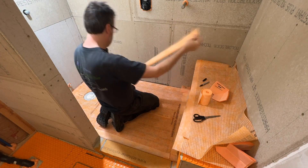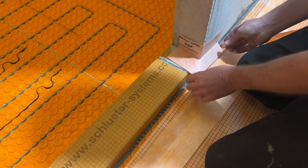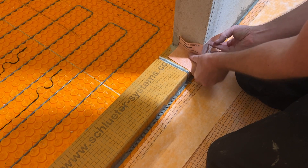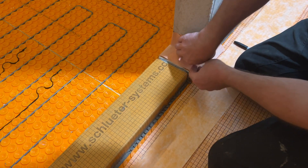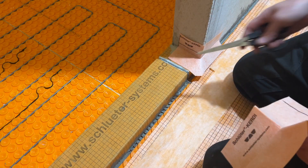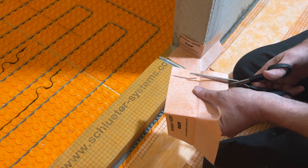I'm going to come over the top with more sheet membrane. We start with the floor, then put in the KERDI corners, then KERDI band around the perimeter, and then the walls will overlap all of that. For this curb, I'm using a KERDI outside corner — folding it straight down on both sides. I'd rather deal with a little overlap than have anything leak; these curbs are notorious for leaking, so you really want to get this nicely sealed.